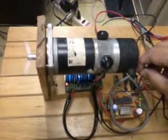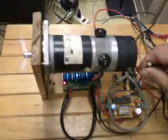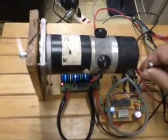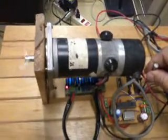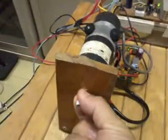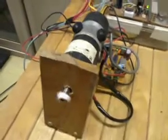That's the basic idea. Notice that this is an open loop system, which means it has no control of the actual speed — there's no feedback. Let's say I try to stop the motor by using my finger to grab at the shaft. I can stop it very easily like this — I have no torque fighting back against my finger.